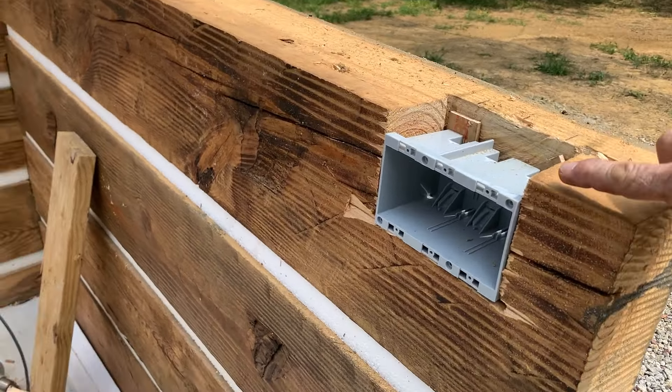We've got the power coming in down here. It comes directly from the panel. It'll come up, set to a box there, and catch that wire, which feeds a ground fault receptacle here. Then I've got a downstream wire going from here back to the ground fault receptacles on that end, and it's carrying the light as well. This will be a 20-amp circuit.